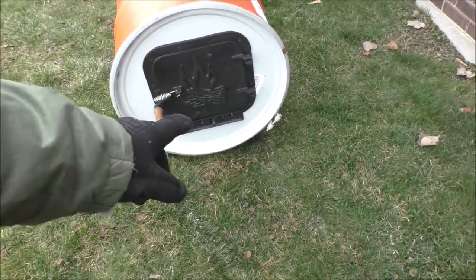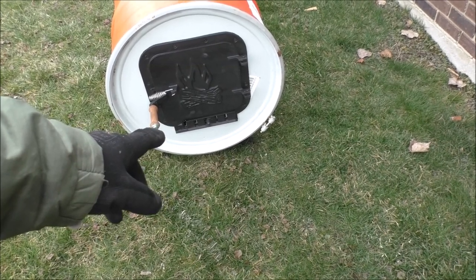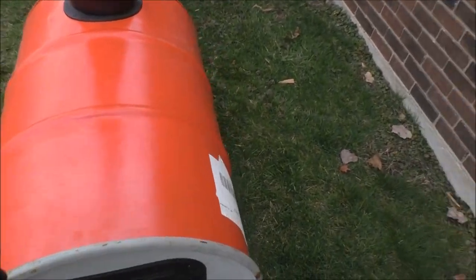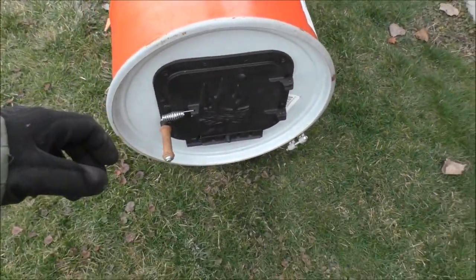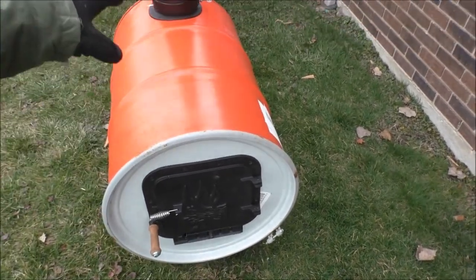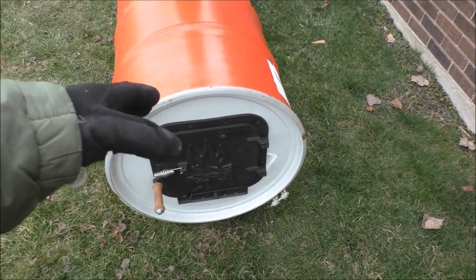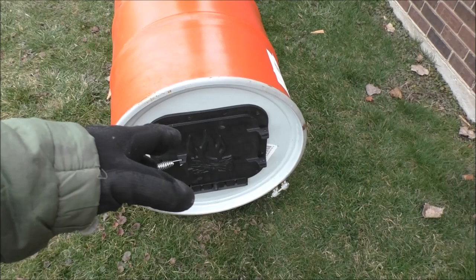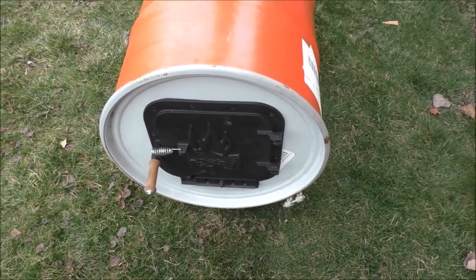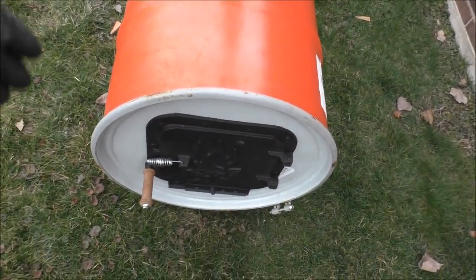That's the plan. I've got the damper wide open and I'm probably gonna do a full burn just to get it going, then damp it down because I don't want it going out of control and burning holes in this thing. They recommend a two-inch layer of sand in the bottom of the barrel, but I'm not doing that until it's in the tiny house because that would be heavy and make it awkward to move around.